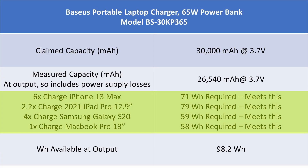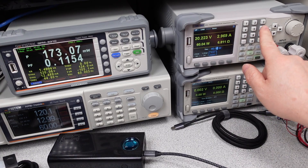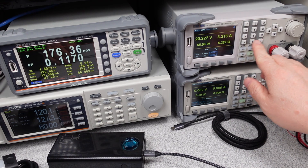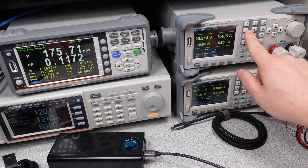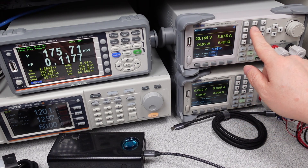In terms of the marketing claims, this power bank does great. We know the real capacity of this device and the claimed charging capabilities from data online. This device meets the basic marketing claims of charging times for devices — you'd be working for several days with this power bank. The power bank can run for about two hours with a 50 watt load, which is pretty good if you consider the relative size. As with any power adapter, we can push this power bank to its limits to see how many watts it can deliver, expecting the device to safely shut down in the case of a short circuit or broken cable.